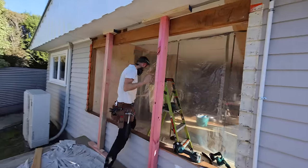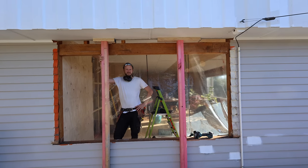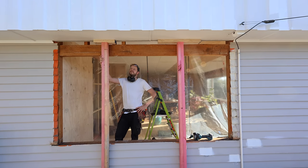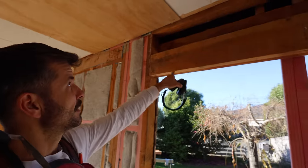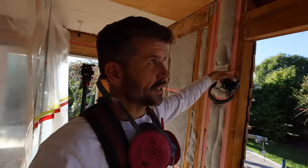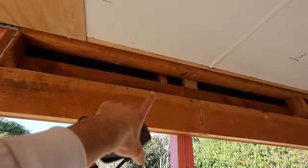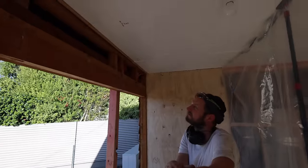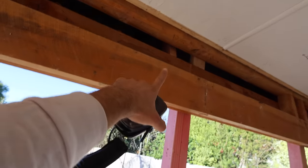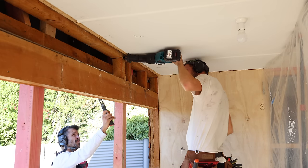Would you put your life in the hands of this propping system, Raymond? Yeah, full confidence - not based on anything, but I'm confident. Unearned confidence - that's what makes the world go around. So what we have here is the beam, the lintel, sitting on our studs over here - they're kind of notched in - and then we've got all this roof weight. All those props are supporting the roof weight coming down in a series of struts and a brace. Raymond put some props on the inside down to the floor, and then the prop carries on down to the deck. We take the beam out and then figure out how to put it in its new position.